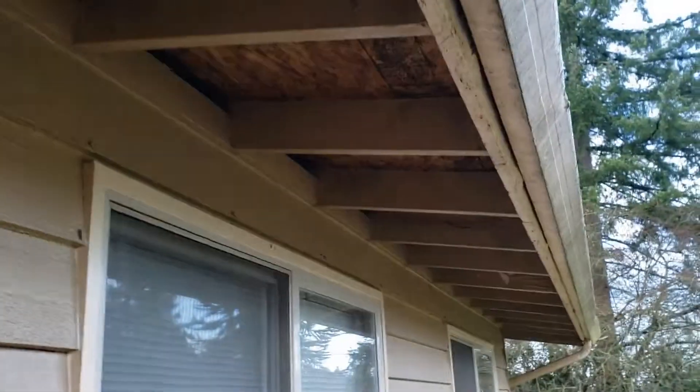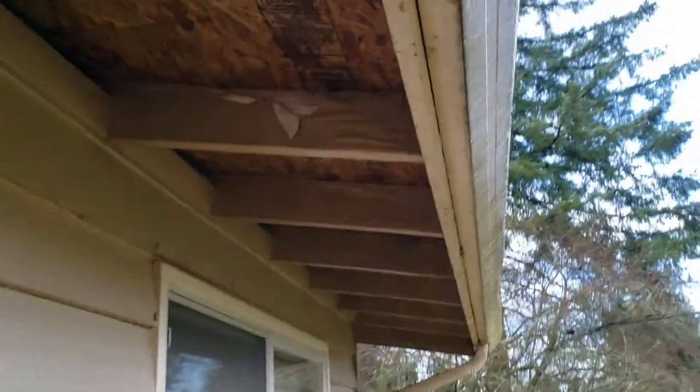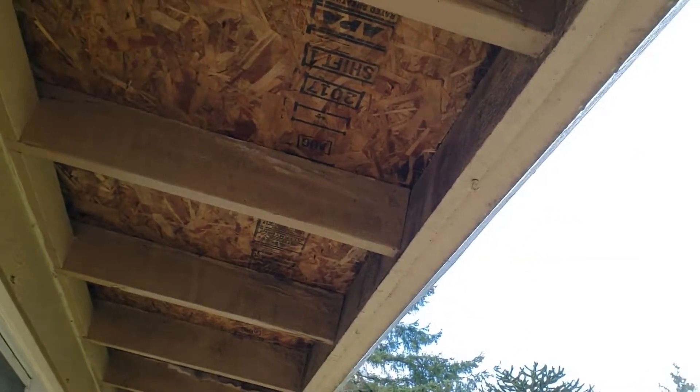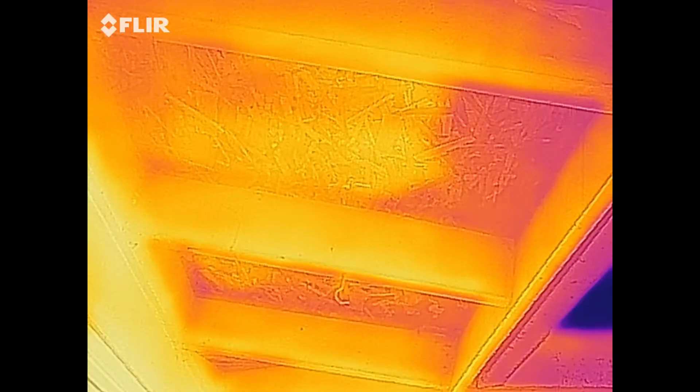There's lots of staining right here. Coming back toward the front, you can see additional staining — it looks like the shingles have been left short of the gutter, which allows water to wick back up to the plywood, causing this damage. There's lots of water staining there. I also did an infrared scan around the house to confirm the findings and found a few hidden spots that were still a little moist.